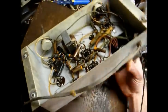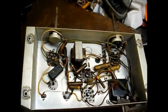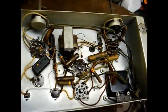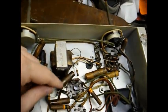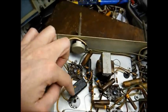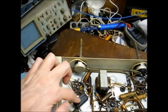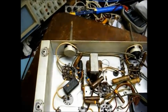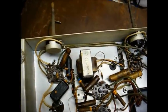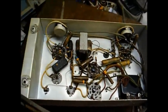These are two electrolytic filter capacitors which will have to be changed, and this is the power transformer. Here's the underside of the chassis — it's nice and spacious, so it shouldn't be too big of a problem to overhaul. You can see all the wax paper capacitors here that need to be replaced. There's a big old mica mold cap — which I believe is actually a big paper capacitor; it looks like a mica cap, but I think it's paper, and those are usually bad too. And there's the audio output transformer.